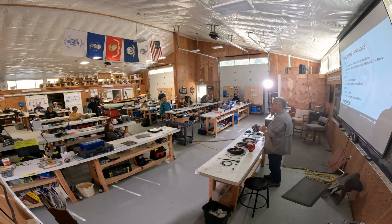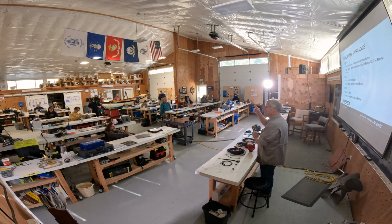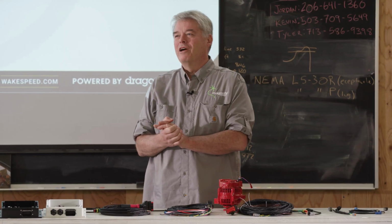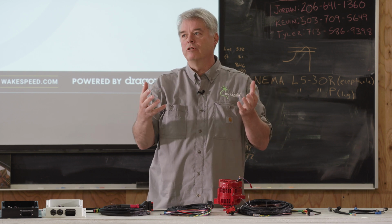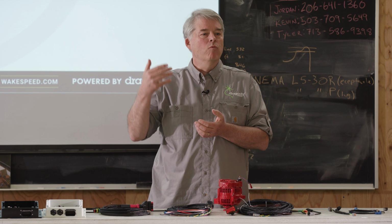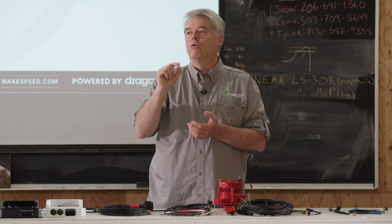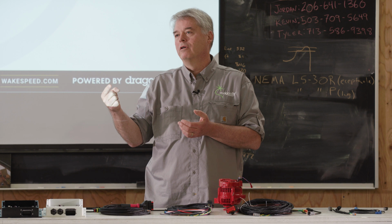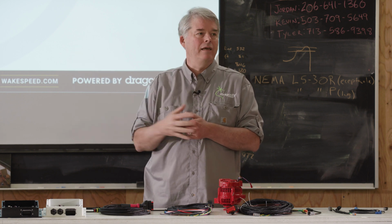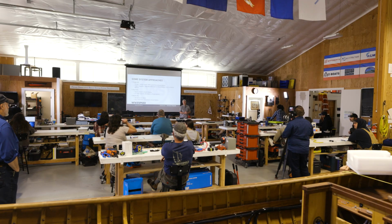By the way, that alternator that I talked about with the 1 3/4 inch shaft, I think that was a 20 kilowatt 12 volt alternator. It's a ferry boat up in BC. So yeah, there are exceptions, but in the real world, you're largely limited to around 150 to 200 amps out of an alternator. And then the wattage is dependent on the voltage, because watts equals volts times amps. So as you double the voltage, you can double the wattage. So 12 volts is 2 kW, 24 volts is 4 kW, and 48 volts is 8 kW. Those are realistically easily achievable outputs from a given alternator head.